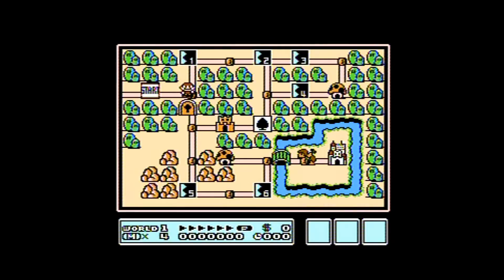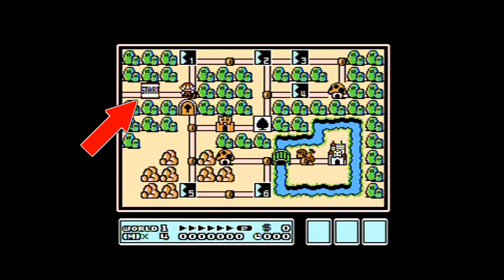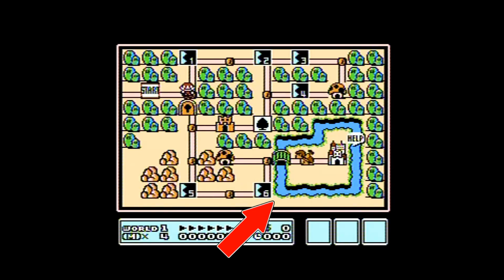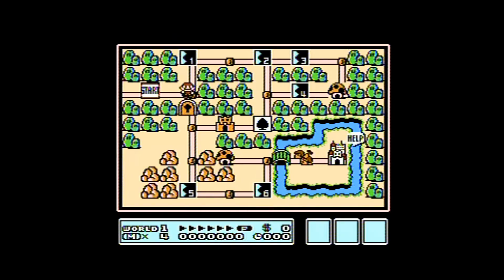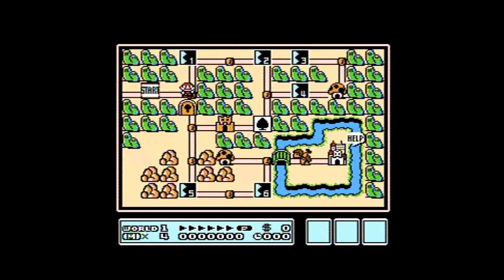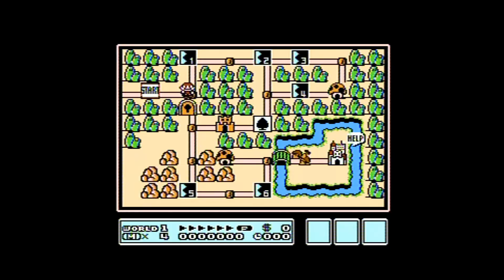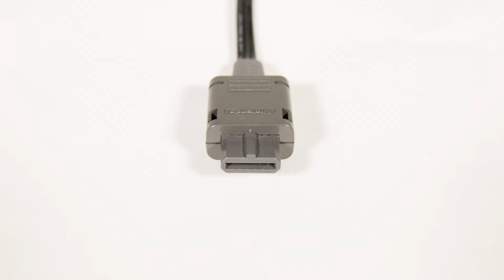Take a look at this overworld video from Super Mario Bros. 3. See how blurry the text is? Now look at the grass around the moat. It's not dancing with the music like the plants are. In fact, it shouldn't be moving at all. It's shifting because when you cram that much analog video information through a single cable, it's impossible to separate it out into a clean signal. And that's it on the NES. That's all you get. But that wasn't the case for later systems.